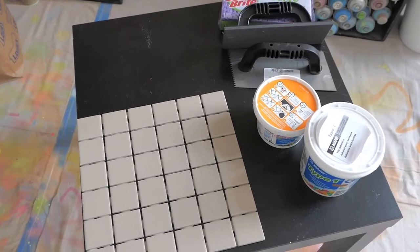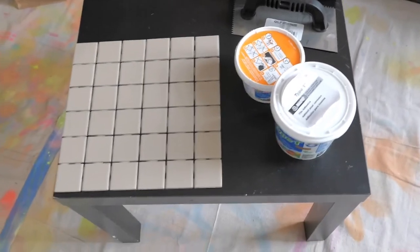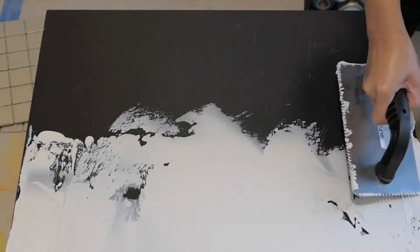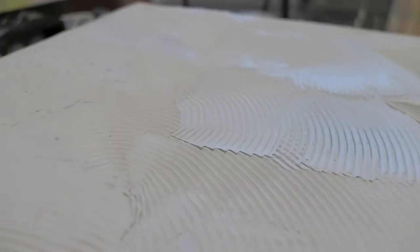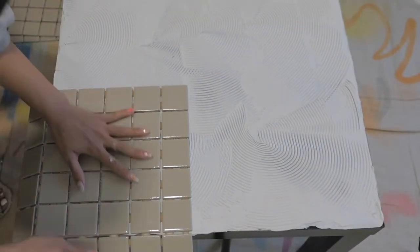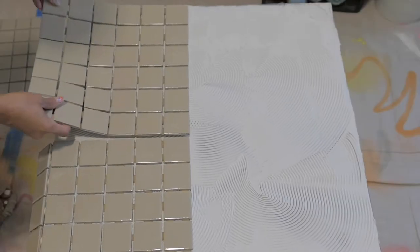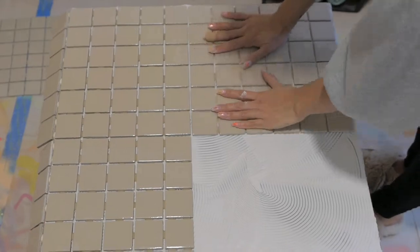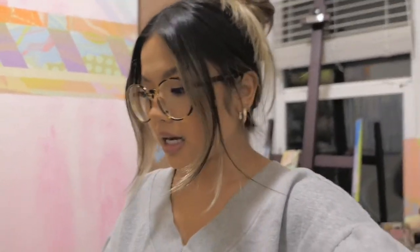If this works out, it'll be perfect. If not, you will learn from my mistakes. To start, you've got to lay the adhesive. Taking the trowel, I tried to smooth out a thin but even coat all over the table. I did end up having to use another tool just to get those sparse areas. Then I used the notch side to make some texture so that the tile will stick to it, and then I just started to lay the tiles. If you notice that left corner of the first sheet was cut off just so that the second sheet, once folded over, will create that left side. The third sheet, all six rows will be on the tabletop, and for the fourth, that front row is going to fold over and create the front side. Unfortunately my camera died, so I couldn't film everything.